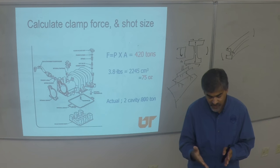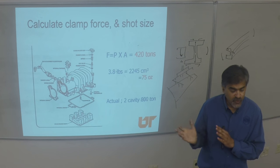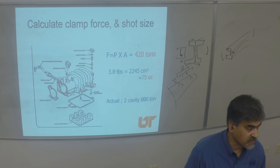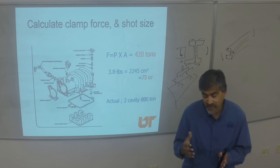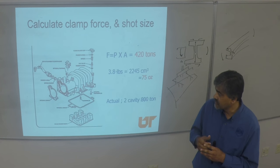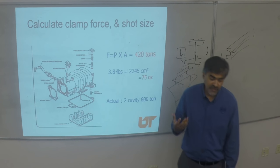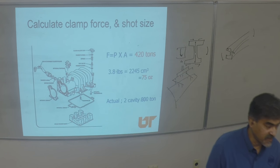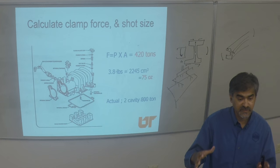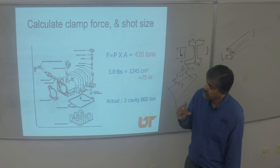You don't overkill — you don't kill an ant with a hammer. When making very small parts, you don't need a big tonnage press — maybe 20 or 40 tons. But for larger parts, you should position your press machine size with respect to the part size. When you're running 5,000 to 10,000 parts, it's about economy — injection molding shops price things by the hour, so you want to optimize your machine for the part size you're running.